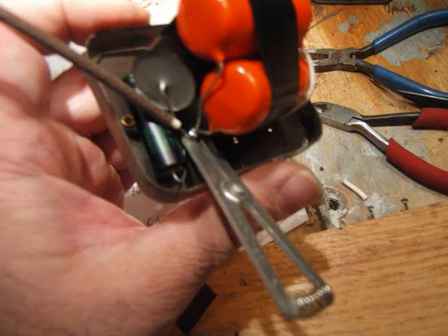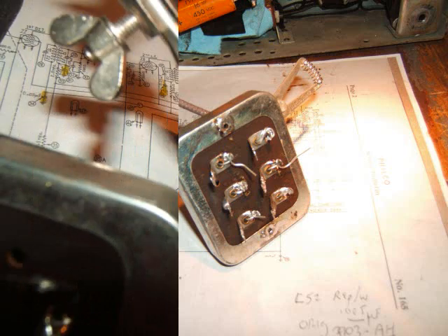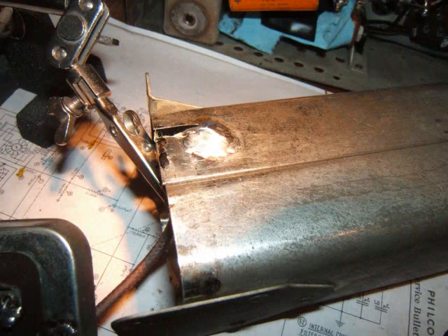Now I'm soldering the ground wire on the inside. After it's soldered, I put a little heat sink clamp on it because I've got to turn it around and solder the other side — I don't want the heat to transfer through to the part where I just soldered. Those little heat sinks are really good. I've got everything soldered up. Now I'm soldering on the ground wire using that helping hand thing to hold it steady. I finished soldering the ground wire — got a nice, smooth joint, not a cold joint — everything's really soldered good.